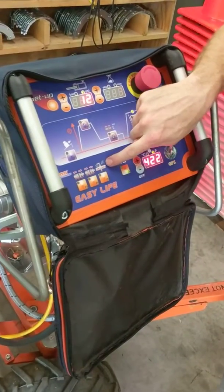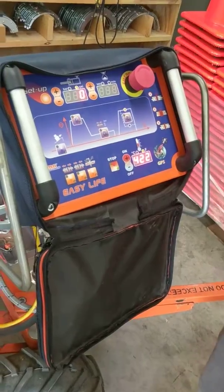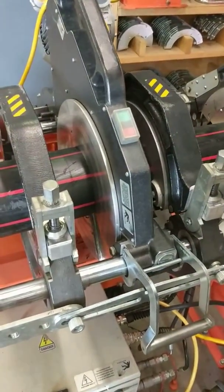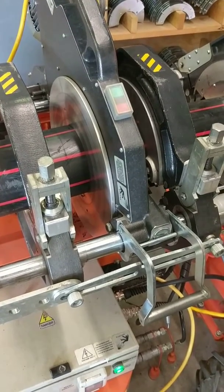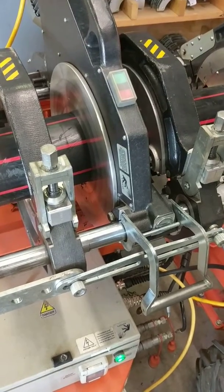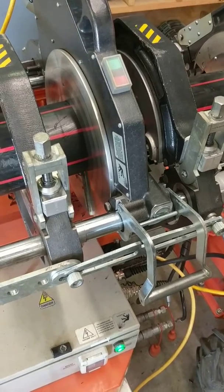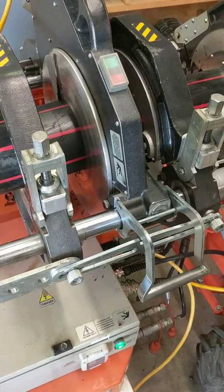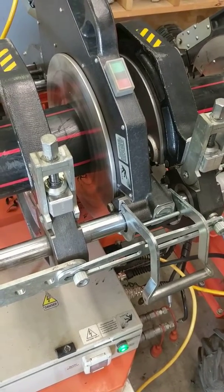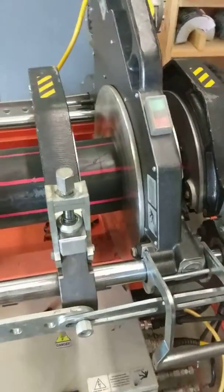Time to press the facer button — you can see the shavings. Let's face the pipe. This is a rough cut with a chainsaw, so we may have to pause the facing in order to clear out some of the shavings. We want to make sure we've got very clean, smooth, matching faces on the pipe. If you look on this side, you can see it's very rough.